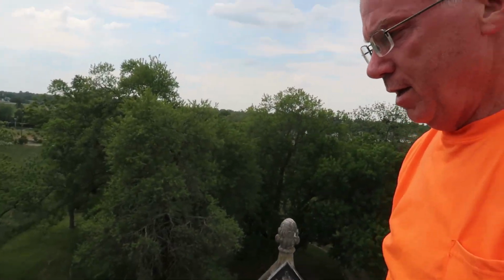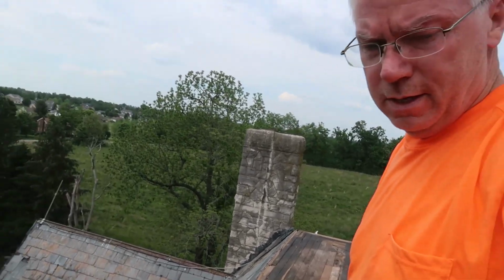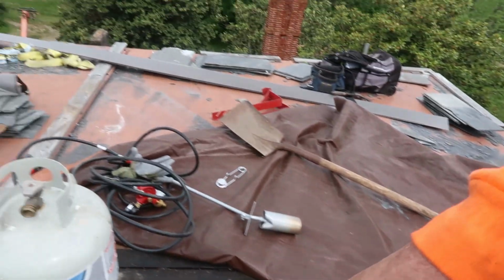All right, we're laying down the fiberglass underlayment for the modified bitumen rolled roofing, torch down. It's kind of an unnecessary step, but if we try to torch down right over wood, there's a chance of it catching fire. So we're going to nail this fiberglass down, and torch down to it. That way, if somebody needs to tear this roof up later to put a flat metal roof on it, they won't have to deal with the tar being stuck to the wood. So we're thinking about whoever has to replace this in about 40 years. Always gotta think ahead. I'll only be 95, so I sure hope it isn't me.